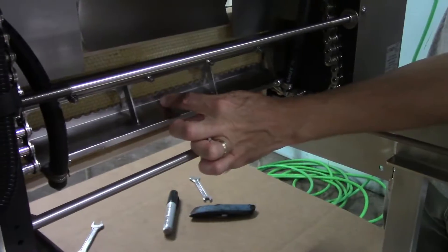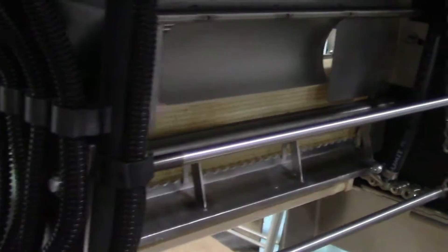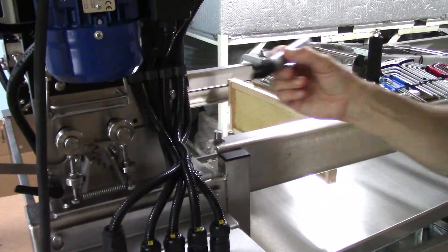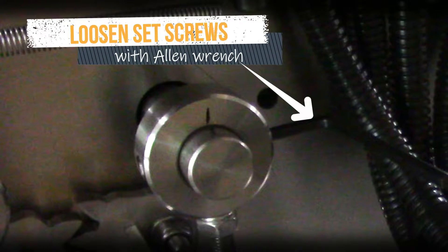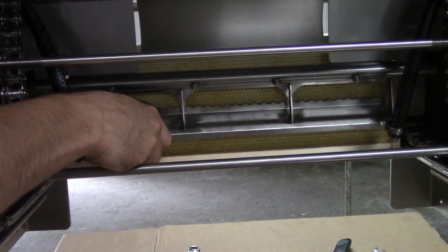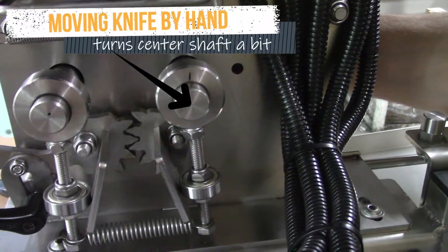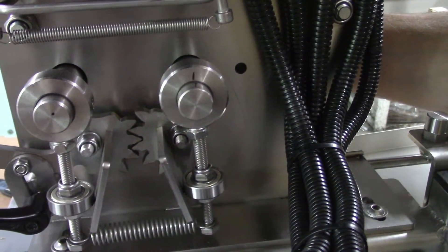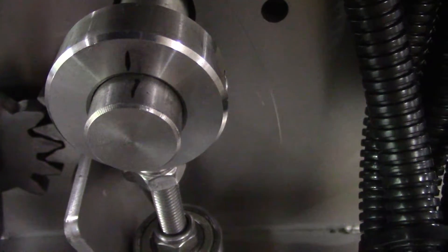The knives can also be individually adjusted. If you follow this knife shaft through the body of the machine, you get to this collar. Mark the initial position of the knife shaft collar on the knife shaft with a marker. Loosen the two set screws on the shaft collar while holding the knife. Move the knife to the desired location and then tighten the set screws. This adjustment is used if you want to move just one knife out from the frame. You can see by the magic marker mark that the central shaft has been rotated a tiny bit clockwise.